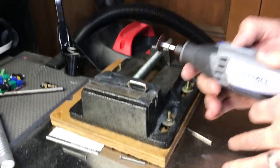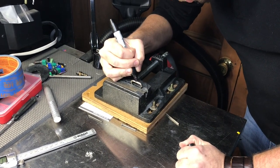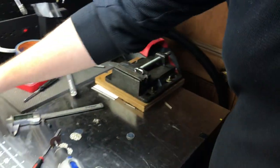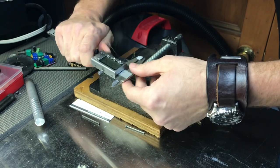Nothing in the original Star Wars was symmetrical. What I'm looking to remove right now is just the weld that's in the center, because I gotta keep this separate. Also, the weld in the center is a little bit thicker than the rest of the D-ring, so I kinda wanna just cut that out. I've marked off a quarter of an inch space — I'm gonna cut it out of the center of the D-ring.